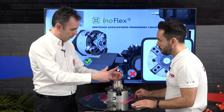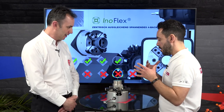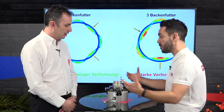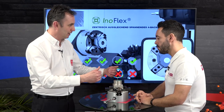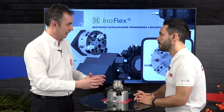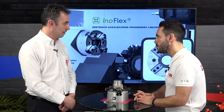You can put quite big rectangular billets in there as well — it's very easy to set up. It's on a serrated-type jaw so everybody's familiar with it. You can offset two of the jaws, so if you've got a rectangular part you can offset those two jaws accordingly. Within the two jaws you can also offset a part off-centre if that's what you want, so it offers true flexibility. As for soft jaws, it takes a standard-type soft jaw so you can mill it to shape or turn it tight to diameter. Also, if you're gripping thinner parts, you've got four even points of contact rather than three, which reduces distortion.